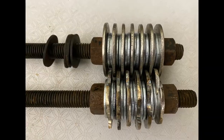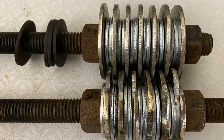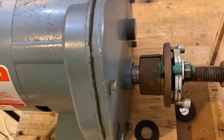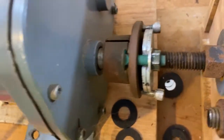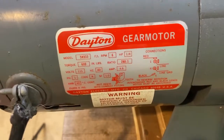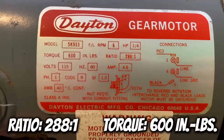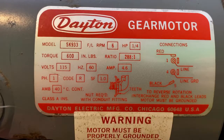You can see how it would look assembled with all the spacer washers in between. I picked up this old gear motor for about 50 bucks. You can see some of the motor specifications here — the key ones to note are the gear ratio and the torque. This one is 600 inch-pounds, which should be just fine given the size of our blades.